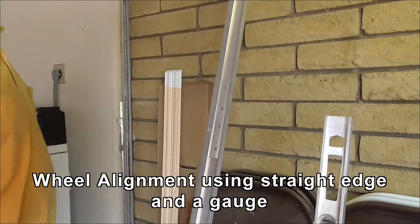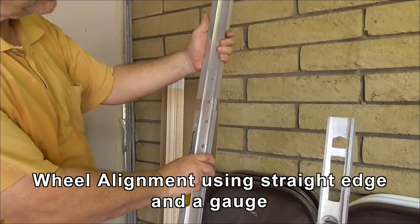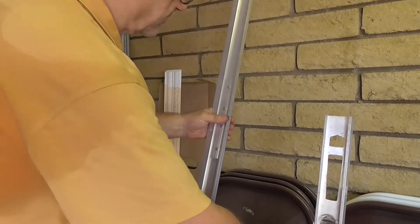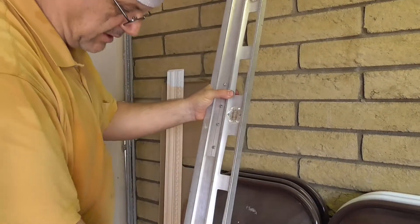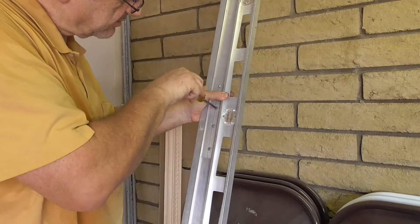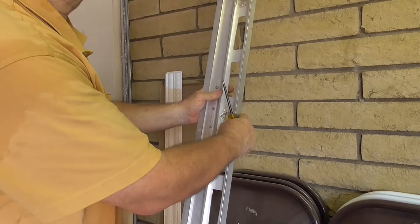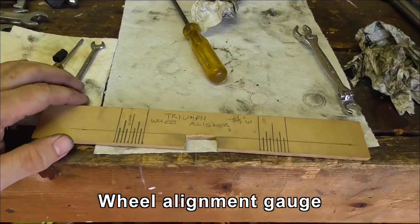I haven't done the real alignment yet. I have this straight edge which comes in two pieces — I just screw it together to join them. To make sure it's straight, I use my square level, hold it against it, make sure the gaps have gone all the way up. I tighten up the screws, do a check — yep, that's got it. Alright, so I've got a straight edge.